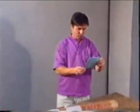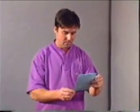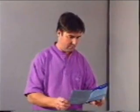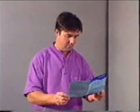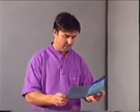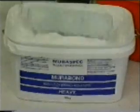It's important that the hanging instructions supplied with your order are read thoroughly to ensure you identify the surface and, most importantly, use the appropriate adhesive for the chosen wall covering and the surfaces on site. Failure to use the correct adhesive system may cause the delamination of the wall coverings at a later stage.